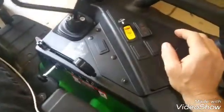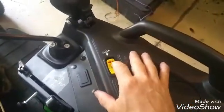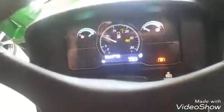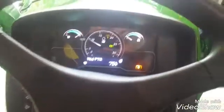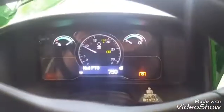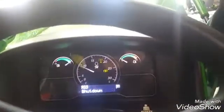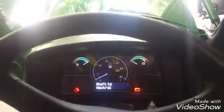I don't have the mower for it yet, but I'll turn on the power takeoff here. Okay, I can hear it running. I'll go ahead and hit the reverse here. Look at that — shut down dead in the door. So it does shut off the PTO when you reverse.